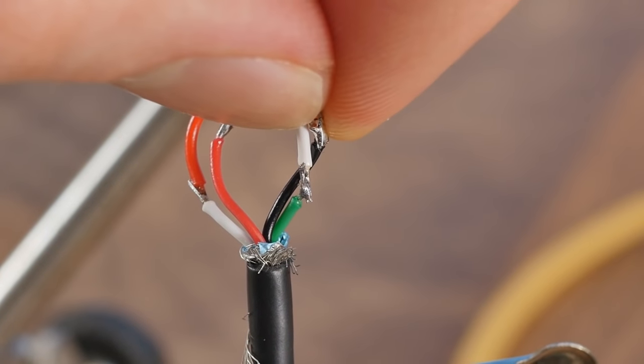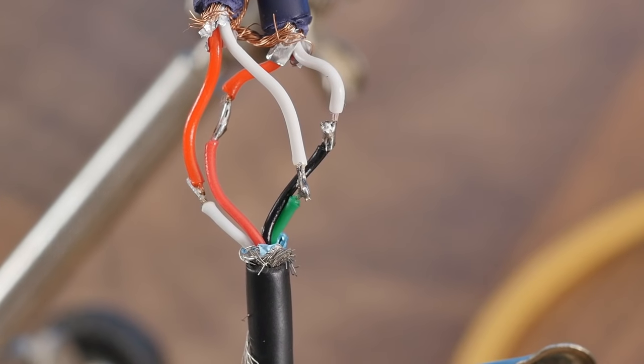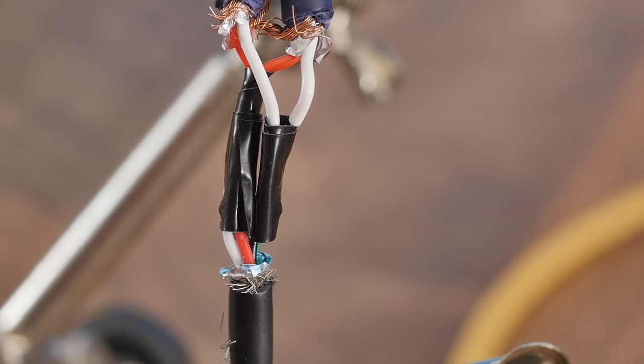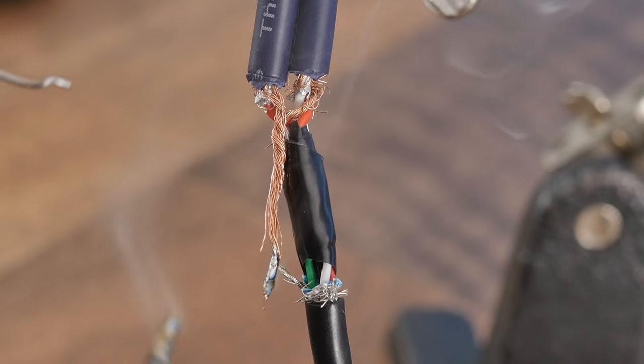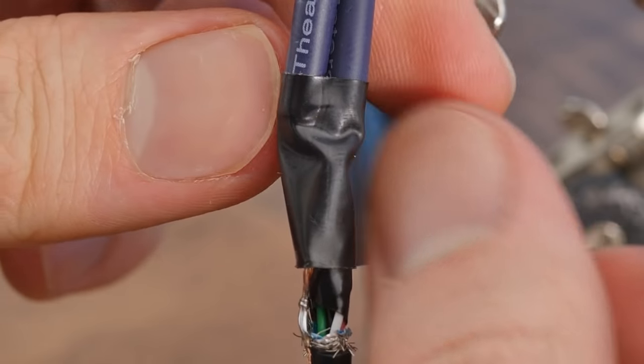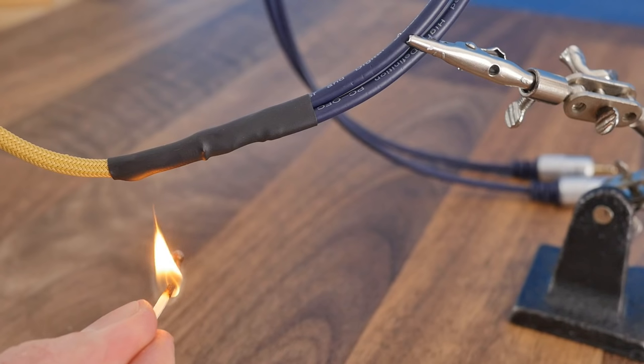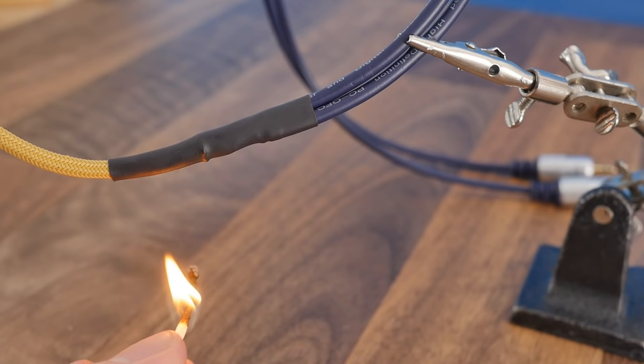As you can see, because the wires are at slightly different lengths, it's impossible for them to touch and short out. So after wrapping them each in electrical tape, the last thing to do is connect all of the ground wires together. This too can have electrical tape wrapped around it, and then we can slide up the heat shrink we added earlier, and carefully use a match to shrink it around the cables.